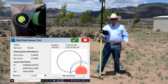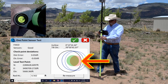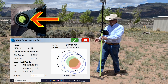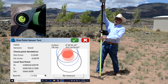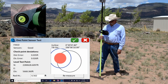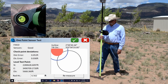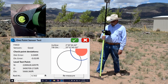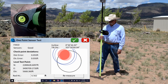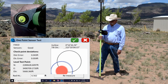So I know that my IMU is calibrated correctly to true north. Now the bubble in the big white box follows the bubble on the pole. I'm facing south right now. By the way, to make this work, you need to have the display on the receiver pointing towards you. So if I center the bubble, the bubble on the screen centers. If I pull the receiver — here I'm pulling the receiver due north — you'll see that the bubble on the screen follows the bubble on the pole. Even though they're not electrically coupled, they're coupled by the IMU and the receiver.